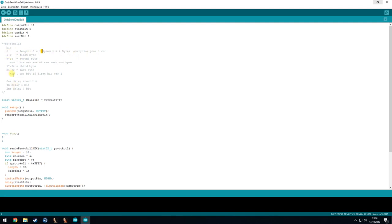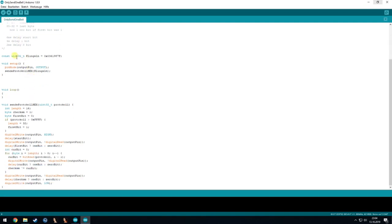And then I describe how it goes, and here I'm just defining the command I want to send. If it's a 0 at the beginning, the system knows it is a call, so we want to call some device. Then there are 5 hex values. If I got it right, these 5 hex values are the serial number every time. So if there were 4 zeros and a 1, then we want to call serial number 1, which doesn't exist, I think, but this is how it works. And the last 2 hex values, or the last byte, is describing what call it is. I will get into that later, in the description of the protocol itself.